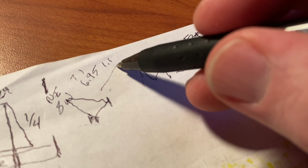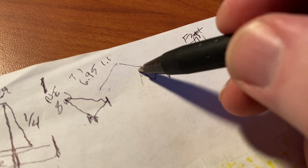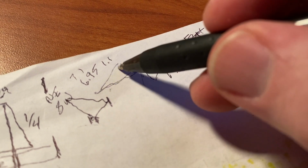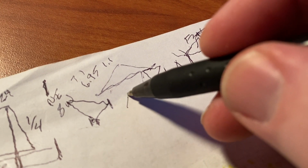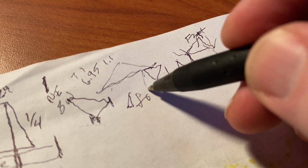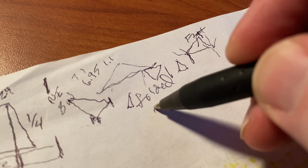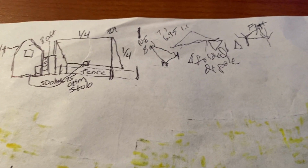And I've noticed they work really well mono or multi-banded too. If you make one like this, try not to get the wires too close together like this, so it becomes a folded dipole, and it doesn't act like a loop. It doesn't have the same properties and stuff.